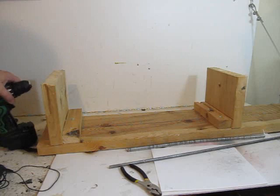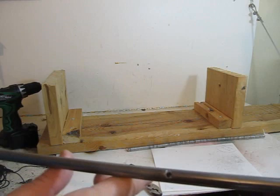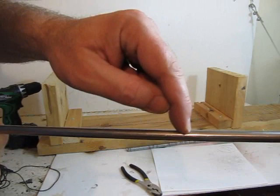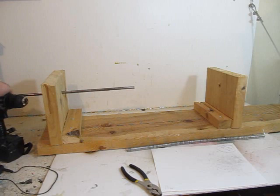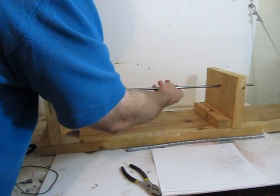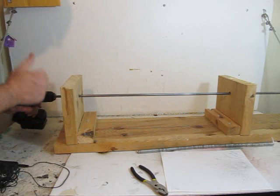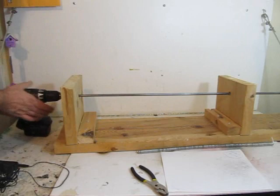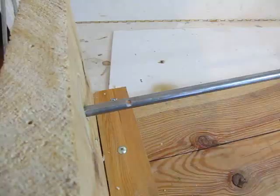Let's look at this jig. I made it out of wood — two uprights and a base — so we can put our rod in it. We've got our 5/8 inch rod, and what I did was file a flat section in it so I could drill a hole in it near one end. That hole has to be big enough to fit your wire. The rod goes in the jig loosely. Put a variable speed drill on it, because you want to go at a nice slow speed, and then you can turn it and wind your coils. It's a pretty simple setup — doesn't have to be anything fancy.